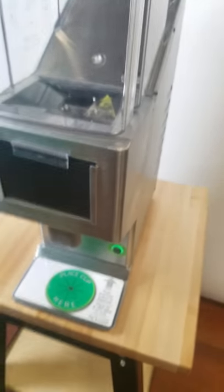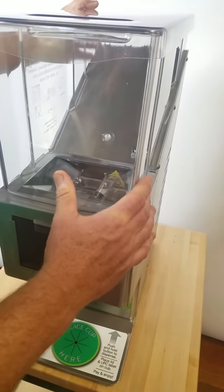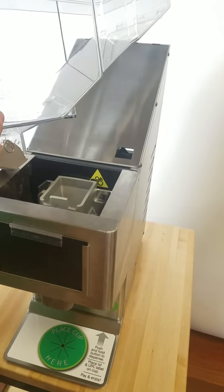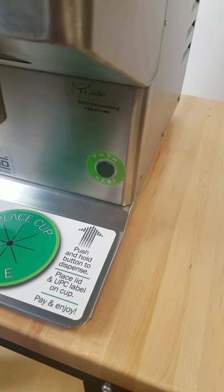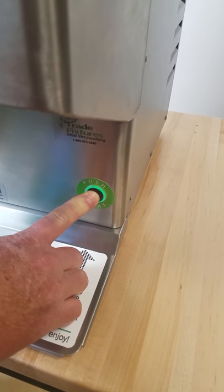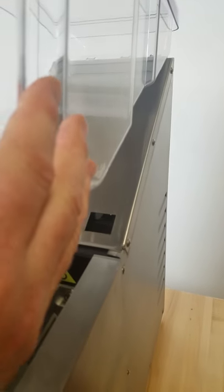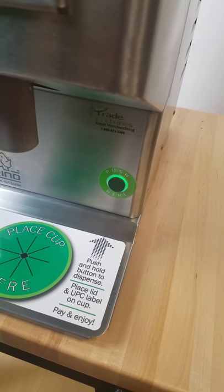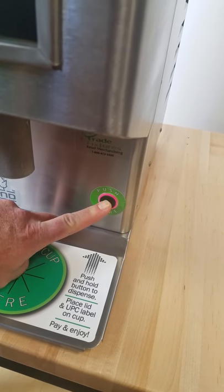What I want to show you now is a couple of safety features on the Rhino grinder. One is with the hopper itself. If the hopper is removed, we don't want somebody putting their fingers into the auger and getting hurt. There's a little sensor here that goes in this hole, and that tells the machine the hopper is removed. So right now you get a flashing green light, and with that flashing green light the machine will not operate. To satisfy the machine so it wants to run again, line these four posts with these four slots in the back, rotate it down, the sensor goes in the hole, and we should have — and we do have — a solid green light. Push the button and the machine runs.